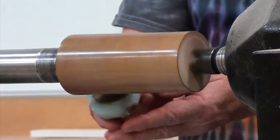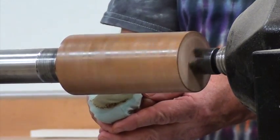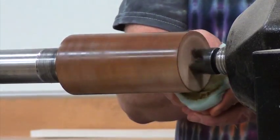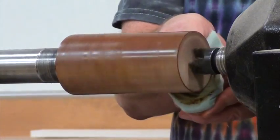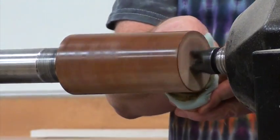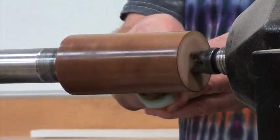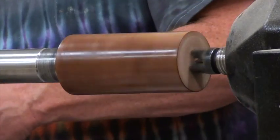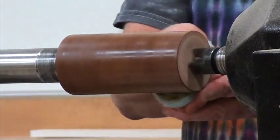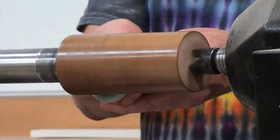It's a wonderful thing. As I'm coming back and forth, I can feel the friction building up as the alcohol is starting to dry out. I'm going to actually tap this with a little more alcohol and try to melt more of this in. You want to try to get all these layers combined basically into one as you melt them with the alcohol — you're melting the one below it and adding to it.